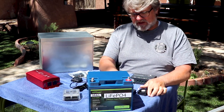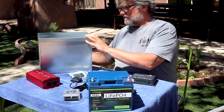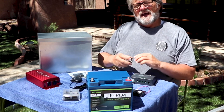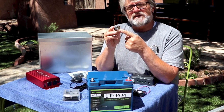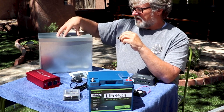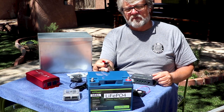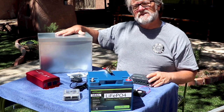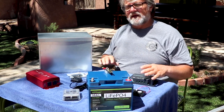What I'm going to do, when I have all of this stuff mounted in there, these fans are going to be mounted on the inside down on the bottom to pull air through this box and actually remove the heat to try to keep the temperature down. I'm going to control it with this little snap disk — it will close at 100 degrees and open at 85 degrees — so it will hopefully maintain the temperature of this box. I've also got a 50-amp fuse, which is the maximum that can come through this, and a resettable fuse that will go on the battery.